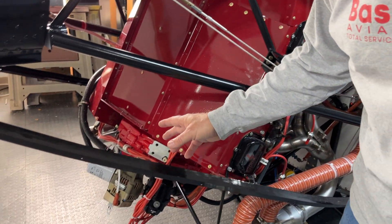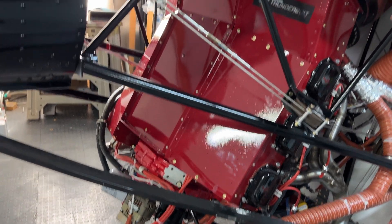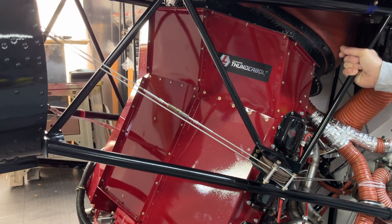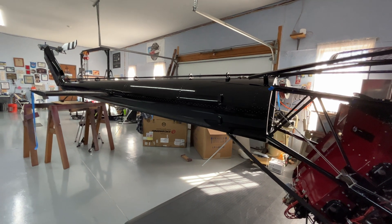The SureFly — actually I'm calling it SureFly, but it's the Lycoming electronic ignition system — has shown up and is all installed. Both it and the magneto are timed 25 degrees before top dead center. And the tail cone is permanently attached, which was exciting.